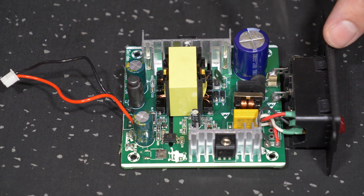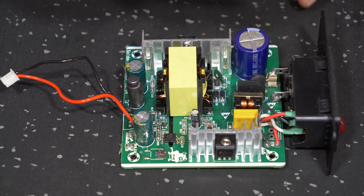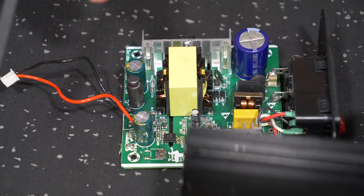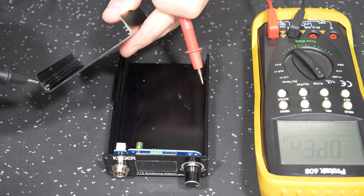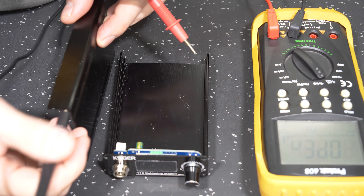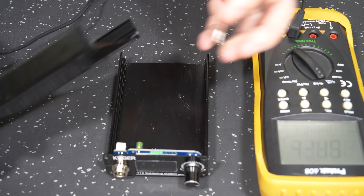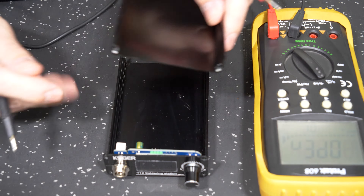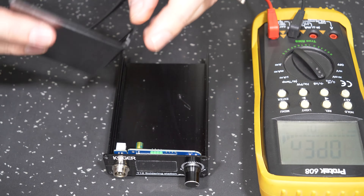There's no primary protection from the main side of this circuit. So we need to put a mod wire in from the earth pin and make sure it's mechanically fixed and conductive to the chassis of the case. Once that's achieved we can confidently say we have an earth to the case, and the case is then deemed safe if a fault condition were to occur. If we look at the front and back faces of the case we can see screw holes where the front and back panels screw in - probing both ends with our continuity tester we've got a solid electrical connection. So we can guarantee we only need to make one connection through either half of this case and that earth protection will propagate through the whole case through the connections of these plates and screws.